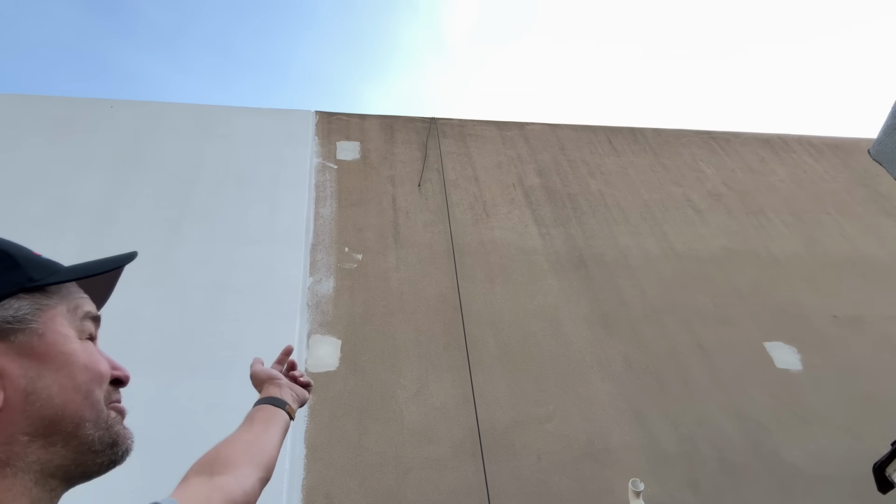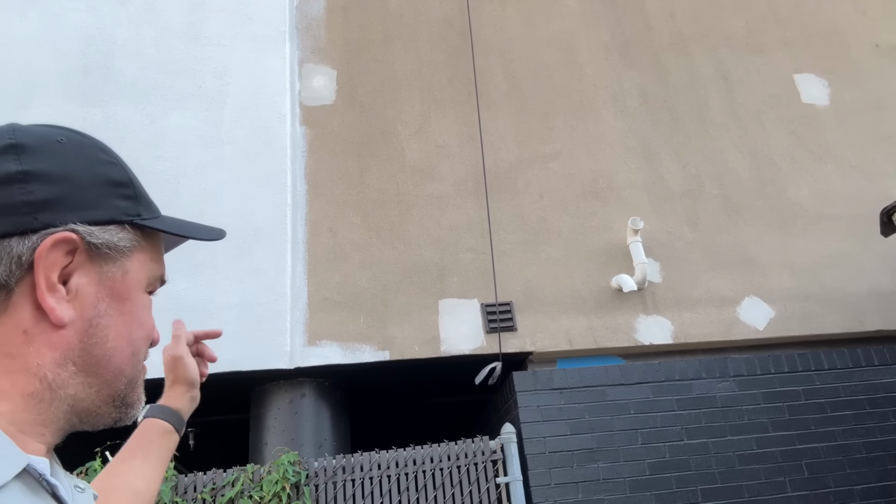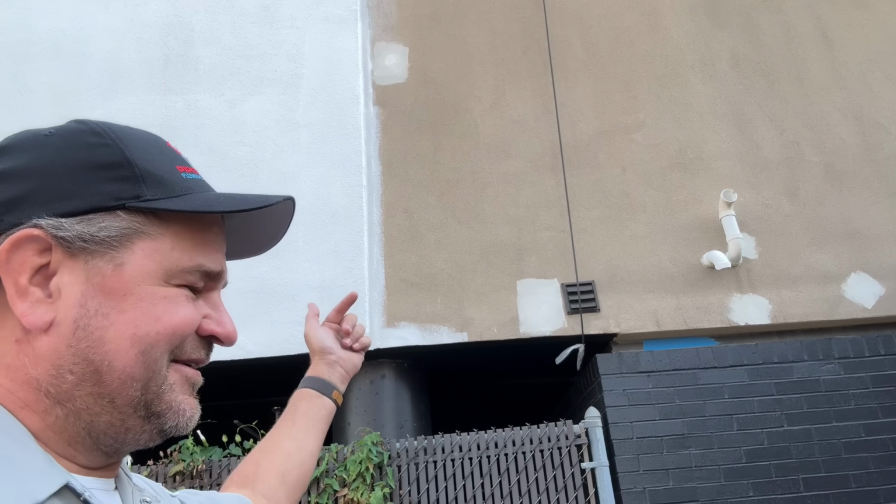All right, so I spoke to the property manager who manages this building, and we're gonna do something very, very unorthodox here. We are going to run temporarily a new control wire from the roof across, down this wall, across the top of the brick here, through the door, and give the doctor and her patient some comfort cooling. It's a temporary solution that, as long as our outdoor unit is cooling properly, we should be okay.